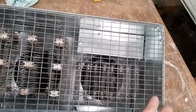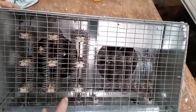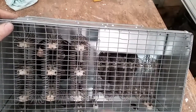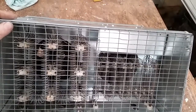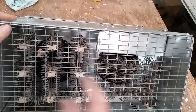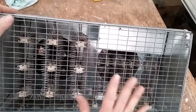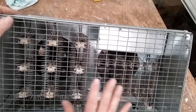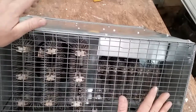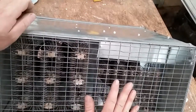Now the business end of this — there's 5, 10, 15, 20 kW of strips over here, and these are seven and a half apiece. So there's another 15 — that's 35 kW if you wired these all for 220. But I've got these things shunt wired so it's all halved. That way these aren't glowing red. I had a customer one time that saw the heater elements in one of these glowing red and got a little weird on me — he was afraid I'd set a fire. So these don't really glow red. There'll be a little bit of orange on the very ends of them, but they don't really glow red and bright.